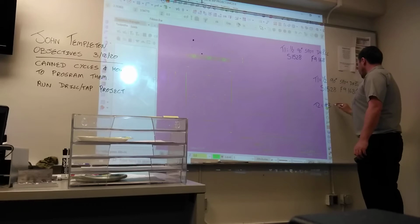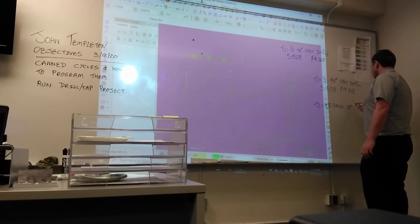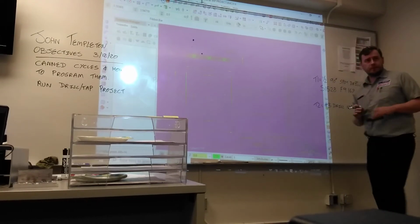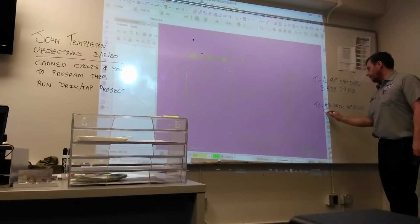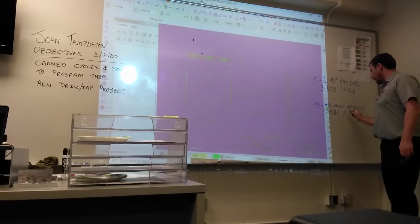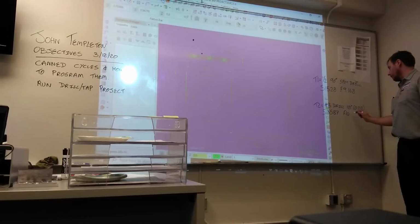What is the number 3 drill? What is that in decimal? 0.213. And then we should have a spindle speed: 3587.300. And a feed rate: 7.761.